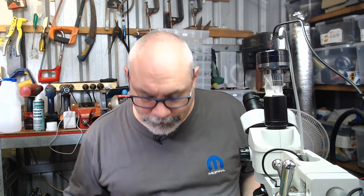It's certainly a beige case rather than a grey one. I know these days they're all beige because of the yellowing of the plastic, but in the early days, the very first Mac Plus was beige, and then they released a later one which was grey. And the way you can tell which one they are is generally if you take the cover off the battery and look at the underside of that, you can usually tell if it's still grey on the inside of the battery cover on the back.